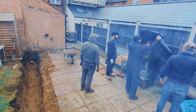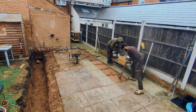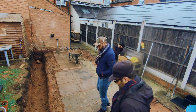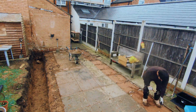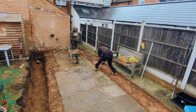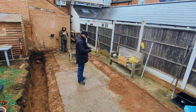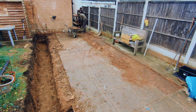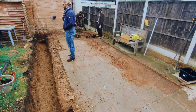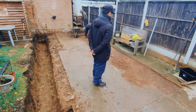They took a little L shape out there, took all the slabs out, and that would be another 6 meter wall along that side, and that would be foundations again. So they started cutting that out. In real time, it took about 4 hours to dig 1 meter into clay subsoil, 6 meters long and about 500 mil wide. So that took them about 4.5 hours.